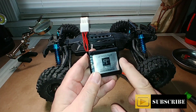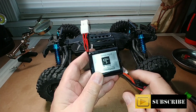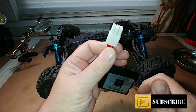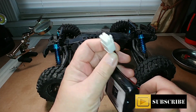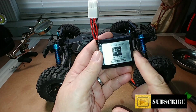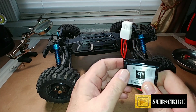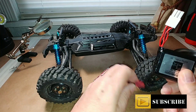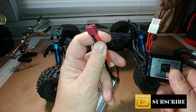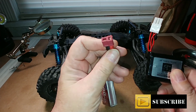The standard battery with this one is a 9.6 volt lithium ion triple-cell battery, 800 milliamp-hour. It has a goofy proprietary connector on it. These batteries can get a little pricey and sometimes hard to find, so what we're going to do is switch out the connector on this truck to accept a Dean's type battery — some people call these T-connectors.